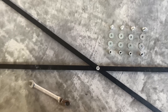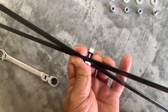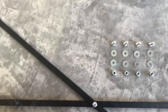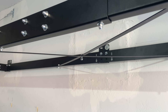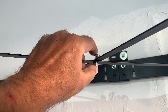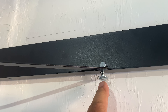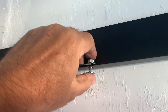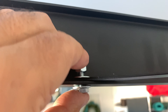Here's the way this is going to go in: one hex bolt going down, no washer, and a hex nut. Then these other four hex bolts are going to be coming up with a washer on each side and a hex nut. Here's the center one — no washer, bolt going down, hex nut on the bottom. The others are in reverse with two washers: hex nut going up, washer, bolt with a washer — and all four are like that. Let's tighten these things up.